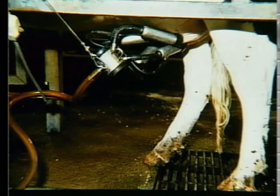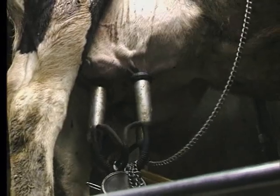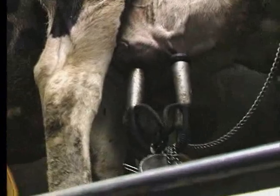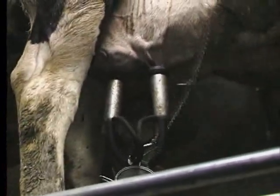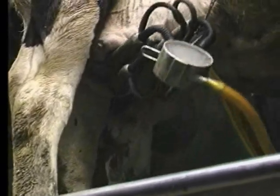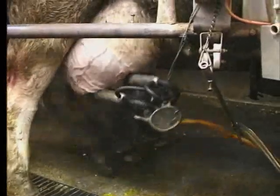Let's take a look at the other side of the story. You see, here's a no-arm takeoff. The cow milked out just fine, we shut off the vacuum, no problem, but since we can't wait we need to pull on the teat cups right away to make sure they don't fall on the floor. Now if you take a close look at this picture and take a look at the skin back there that's sort of stressed, there is no doubt these teat cups are coming off under residual vacuum.